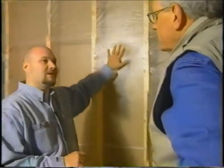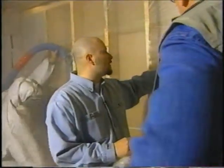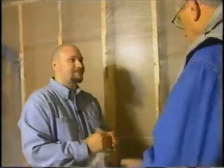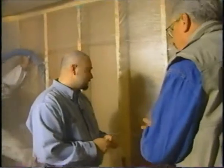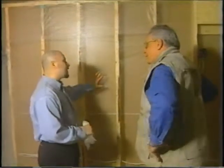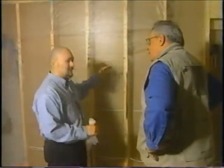Is there an adhesive as well? Because obviously it hangs very well. Exactly. In the wall bar system, because it has to stand up in the walls, there's a foam adhesive in the product. What that does is it causes the product to settle into the wall and stay in an upright vertical position. The nice thing about it, I find that you blow it and it goes in around all the wire conduit, any of the cavity wall piping, and certainly silences water within the walls running through plastic or metal pipe.